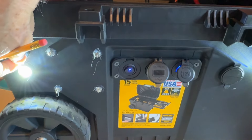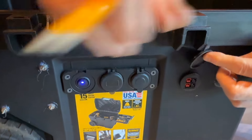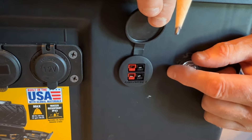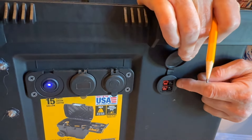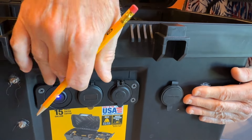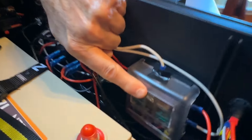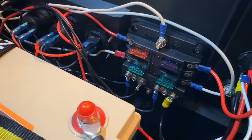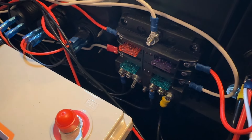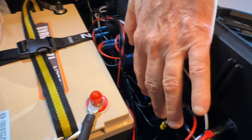I'm going to turn off these lights and ports. The other thing I want to point out is that I also have two sets of Anderson power poles. Anderson power poles have pretty much become the de facto standard for all amateur radio gear. Each of these output devices — the work lights, the USB and 12-volt port bar, and the Anderson power poles — they're all fused. Down here in this fuse box you'll notice we have different fuses for each individual item.